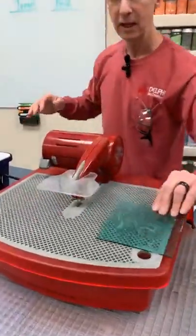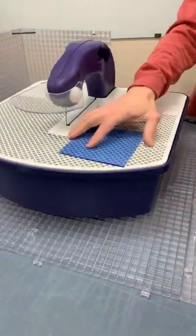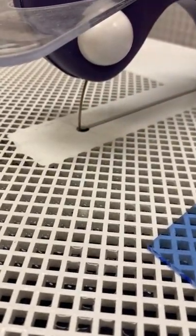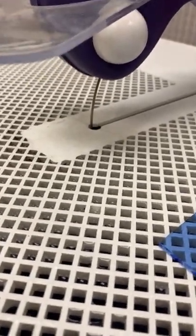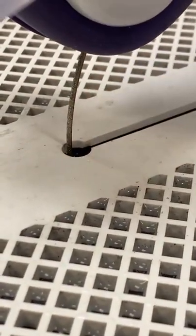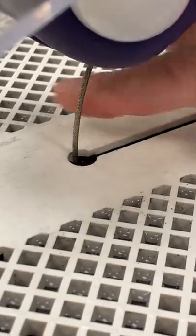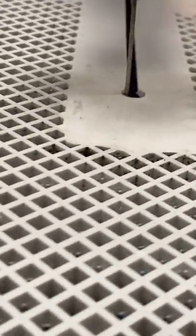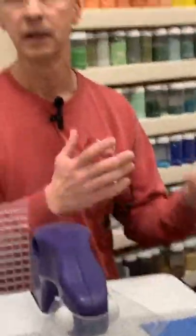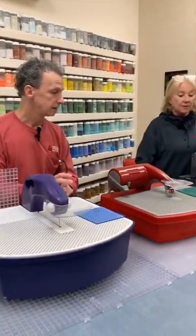Now the ring saws — we have a couple down here. The blade is harder to see, but on the Zephyr you can see more of it exposed. It's a stiff metal wire — not flexible like a band saw blade — and it's round, with diamond coating going all the way around the entire wire. The key advantage is that you can cut from any surface: front, side, or back.